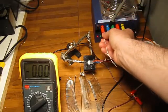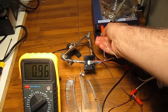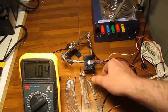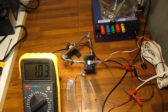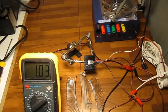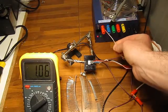I apply the minus 5, and current is starting to flow. It's floating a little bit because the connections aren't perfect, and also the resistor itself will heat up a little, so its resistance will change and therefore the number of amps can fluctuate slightly.